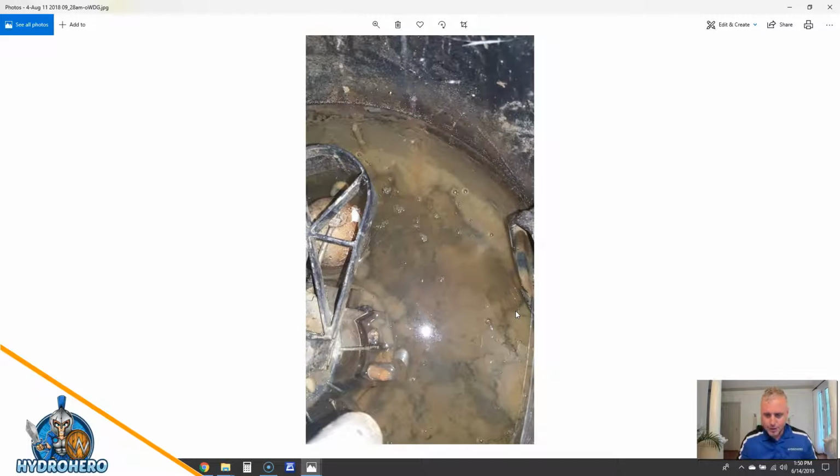So once we pulled the vapor barrier back in our initial inspection, we looked at the drainage, and they did have a decent basin in there, and the pump was working. It needs to be cleaned out. There's no good maintenance being done to it. There was only one pipe coming in, and that was from the exterior. They did the footer drain tile on the exterior perimeter of this house, and then had it punched through.